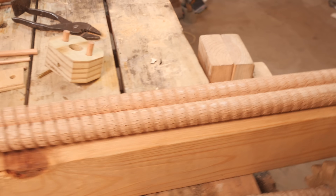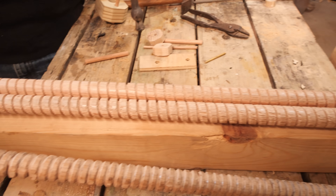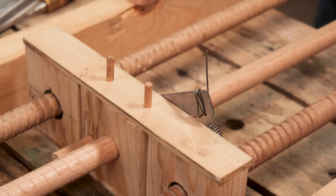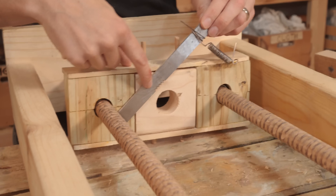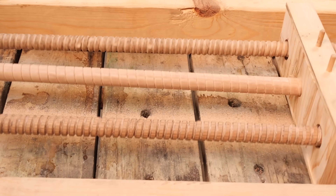However, there were a few problems. The main thing is that our lead screws are pretty far spaced out, so to make something much more compact like standard threading, it's going to require some pretty large gearing changes. Also, a lot of people wanted us to make our own lead screws and replace the hand-made ones with machine-made ones — potentially getting something even more precise. The issue is that the DaVinci machine as I had it built actually reverses the thread, so the two rods we made are backwards, meaning anything we'd make after that would be reverse-threaded.